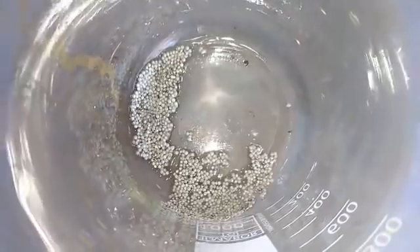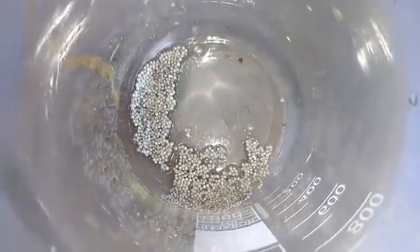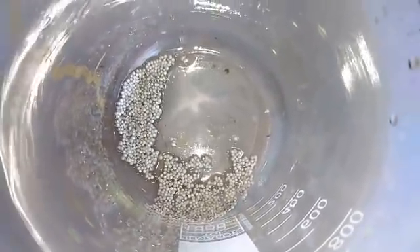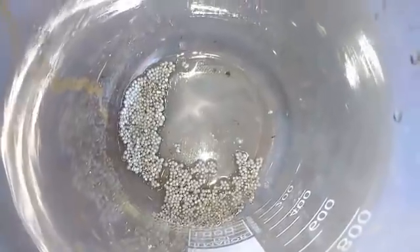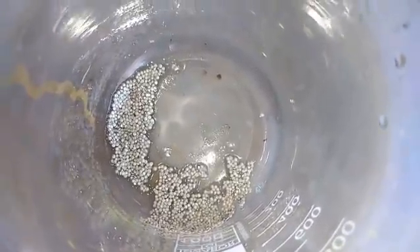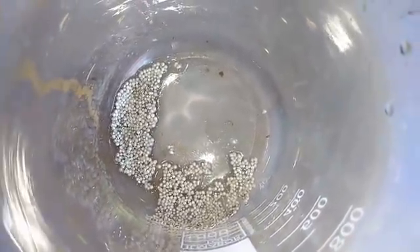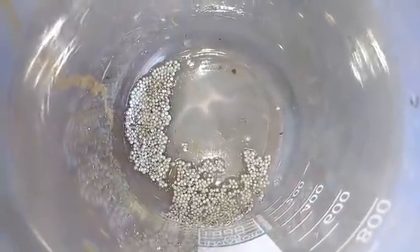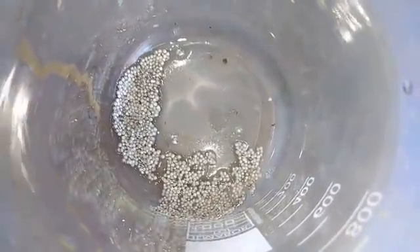So I don't know — maybe there's some palladium, maybe not. Right now I will treat that with nitric acid to refine that silver. Probably you can melt this straight and get very close to 999 silver, but I want to do the full process — recovery and refining. So I will refine that silver with nitric acid, then drop with hydrochloric acid, then convert the silver chloride with caustic soda and sugar to elemental silver, and on the end I will melt that into pure silver.